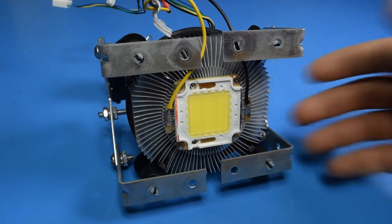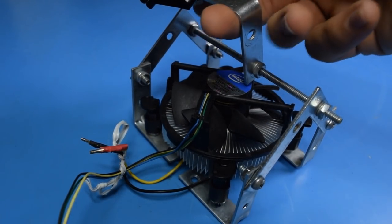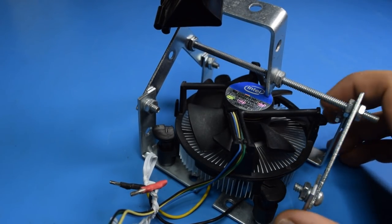These coolers are easily up to the task — I think they're rated to dissipate 160 watts, so a 20 watt LED is nothing. But if I do turn the fan off on this mount, I feel the heat radiating up and I've even had this bar get too hot to touch. So you really can't get away with pure passive cooling.